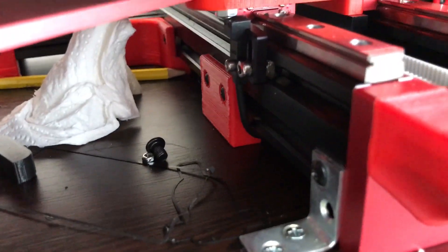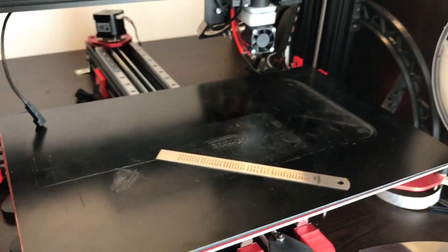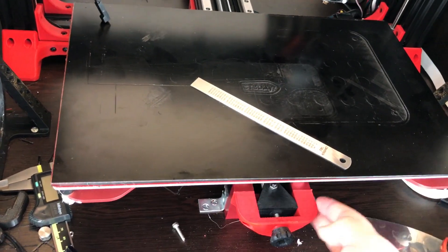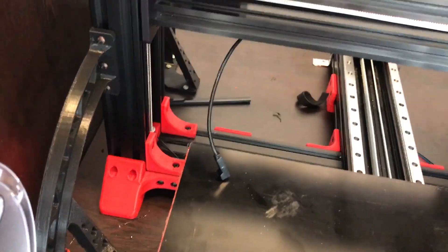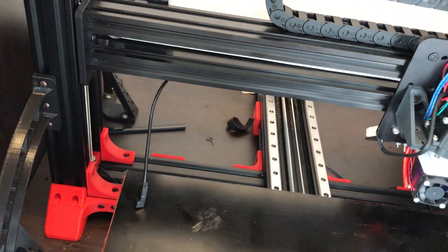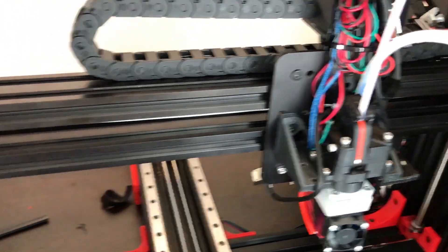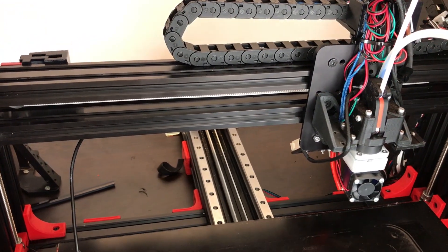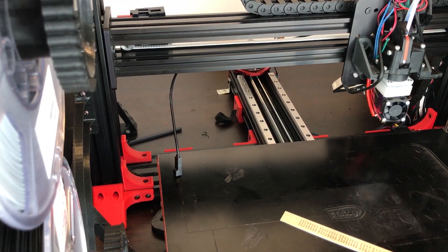I also relocated the homing switch to allow for the added height, because because of the height of the rails I'm losing a little bit of Z space here. Everything is working smoothly-ish - there were a few problems when aligning this with the rails. But somehow this end stop switch sensor stopped working. It's not detecting the X homing and I didn't even touch that. I checked all the wiring everywhere and everything is wired up properly - it's not like a connector got loose. This sensor isn't responding to anything metal in front of it.